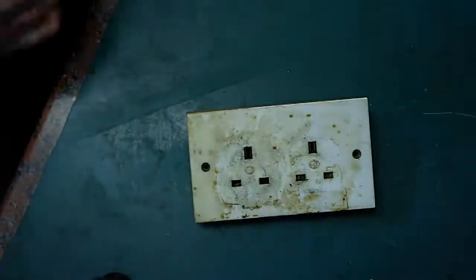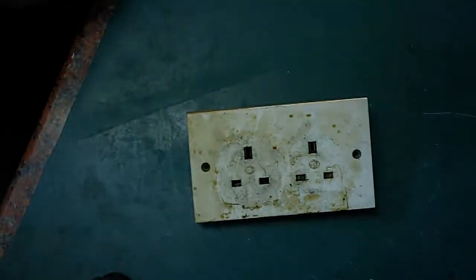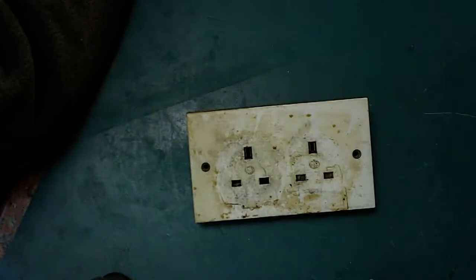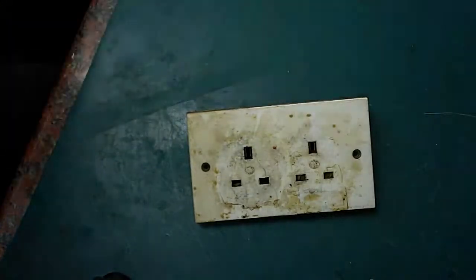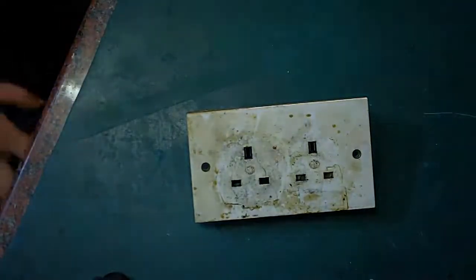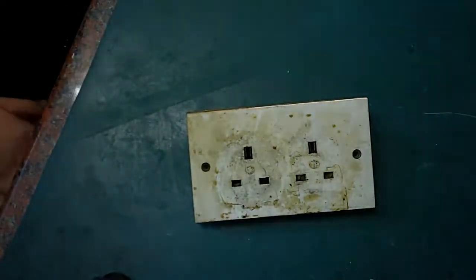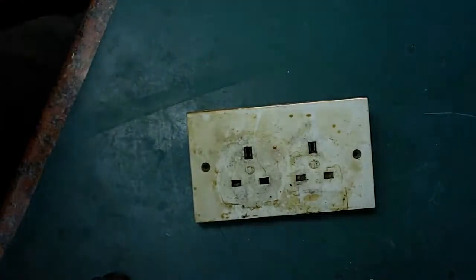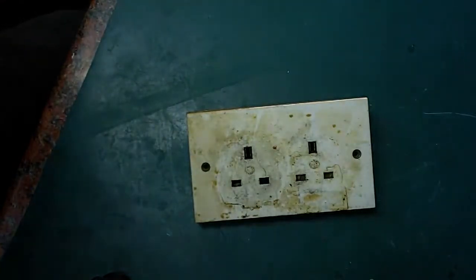So I popped down, and in the back in the kitchen, he's bought a new industrial microwave, because he'd run out of capacity with the one that he had. And basically what they'd done, these things run at about 3 kilowatts each, and he plugged it in next to his current industrial microwave. So he had two 3 kilowatt microwaves running on this one socket, and apparently there was a flash and a pop from the socket, and neither of the microwaves would come on.